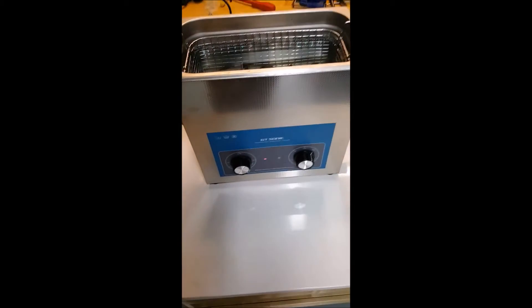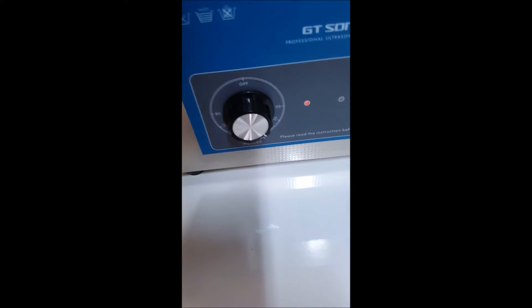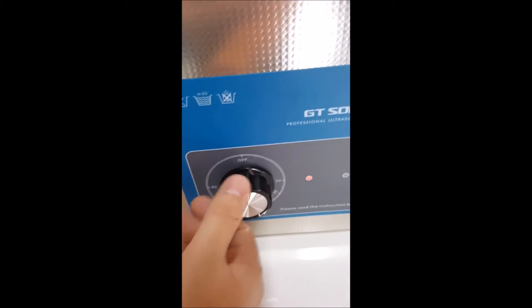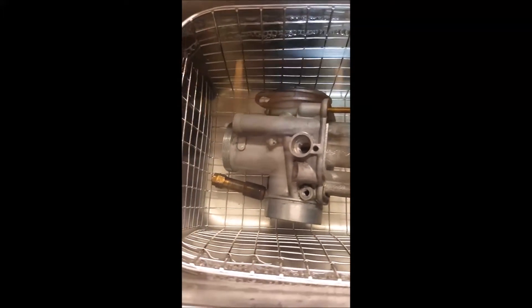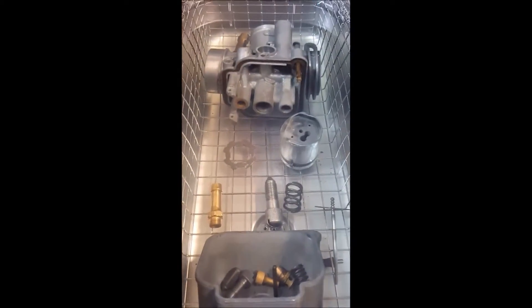It's all cooled down. I had a good examination of my bits and I'm not massively pleased with it, so I'm going to have another go. This time I've filled the tank with water straight from the tap — you can see it's about 20 degrees, so I'm going to leave the heater set to about 40. I've filled it with just plain tap water and Fairy liquid, which is, in the UK, just a domestic detergent — it works as a surfactant. I had a scrape of some of the bits and pieces, so where it was baked on and sludgy, I've been able to scrape stuff off.